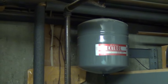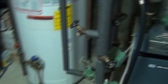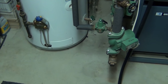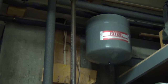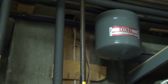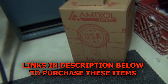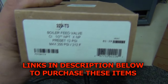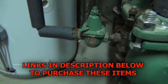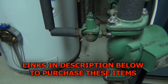While I do that, I'm also going to replace the expansion tank. That thing is still technically good but it's a good time to do it. The feed valve and the expansion tank work hand in hand — they're both matched in pressure. That thing up there is 20 years old. Rather than wait for it to fail, I figured I'd just take care of it today. We have the new EX30 expansion tank and the same exact feed valve, so we don't have to change any of the piping.